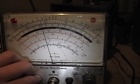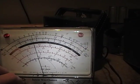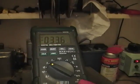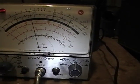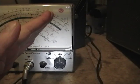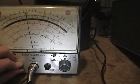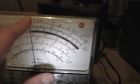This DC plus and minus is kind of a handy thing. You may be used to multimeters where you have a positive and a negative terminal and the meter reads plus and minus. Well, you can't go negative on a meter movement because it just goes way off to the left, so when you put it on negative volts DC it effectively switches the two leads on the meter so it gives you a positive deflection, but you're actually reading negative volts.